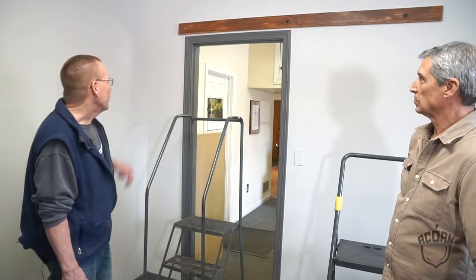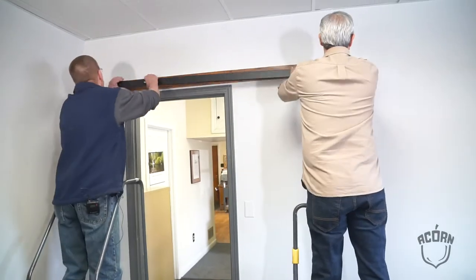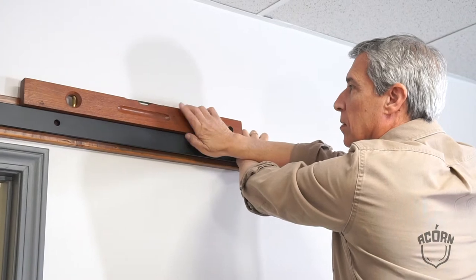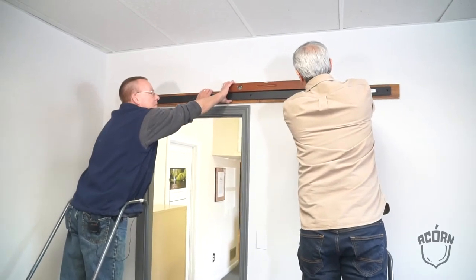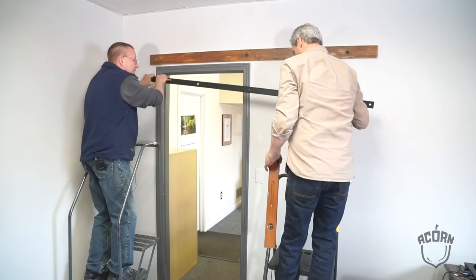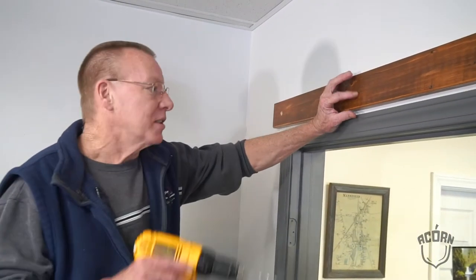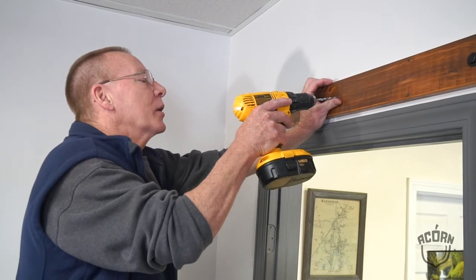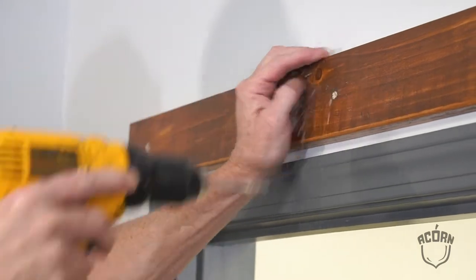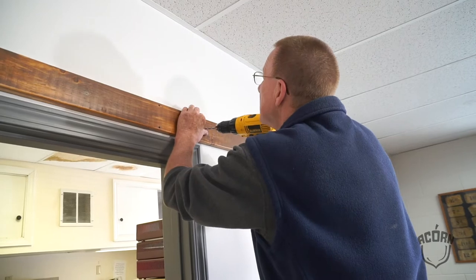The first hole is our locator hole for the rail, and we've already pre-drilled one hole. I'm going to locate it — this is going to position the remainder of the holes and ensure that the rail is level. I'm going to remove this locator, and then drill a small pilot hole, enlarging it once these are set. We're going by the center of our locator bars, and I'll go right down the line to the next hole and the two additional holes after that.